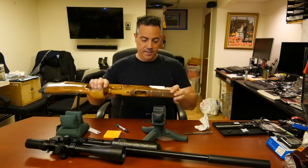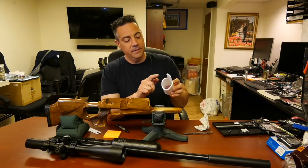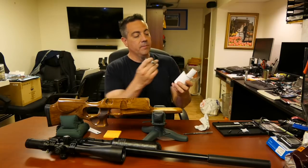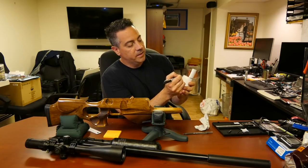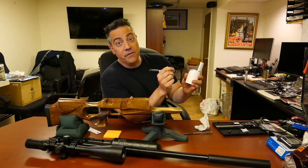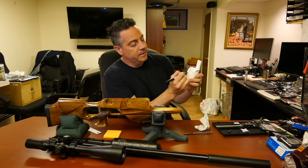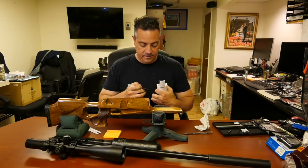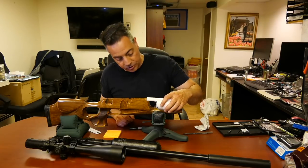I see what has to be done. So a little filing down here, a little bit on the outside. So now I'm going to remove... Again, this is a trial and error thing. Using a file or sandpaper, I'm going to sand these outer edges. I'm going to kind of bevel them. And again, I can see that that's the shape here. It's kind of beveled. So we're going to try to match that.